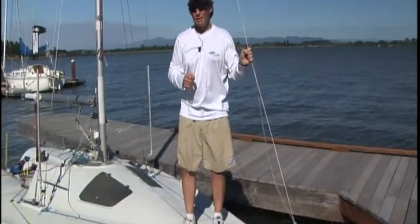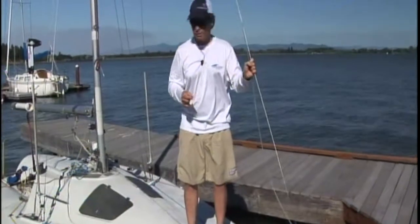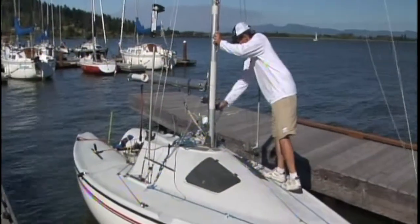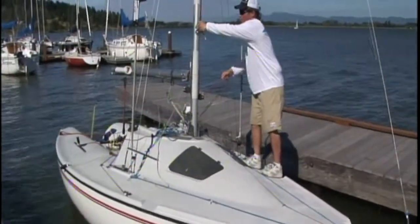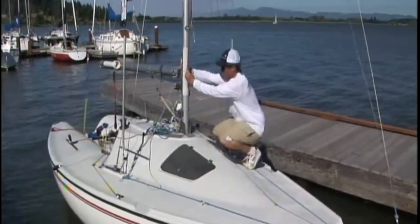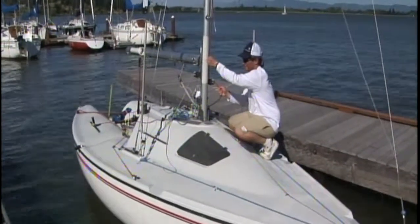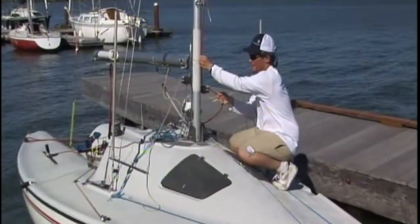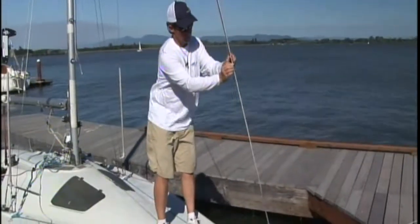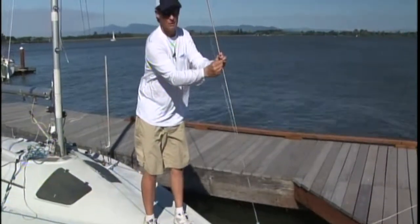Now what we recommend, and the vast majority of sailmakers recommend, is that you rake the mast 51 inches. Now, in order to establish whether you have that rake or not, the advice is to take your jib halyard and take it to the bottom part of the black band, your measurement band for your gooseneck. Right to the bottom part there. Tighten it up and then swing it forward and make a mark with the magic pen right here on the forestay. That's how you find that point.